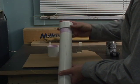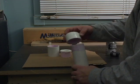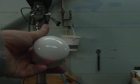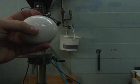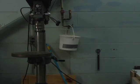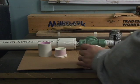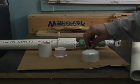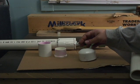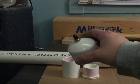You drill a half-inch hole in the cap for your nipple, for filling it up. I am drilling right in the middle of the cap — I have measured it out, and I am using a half-inch drill bit on the drill press. We have this drilled out now — we have a hole in it. We are going to take the nipple, put Teflon tape on it, and screw it right in there. You can use some JB Weld after around the outside — we have not had to yet, but we have it just in case. There we are — we have the nipple attached. You can see it is drilled through, and this is where we are going to air-fill our compression chamber.